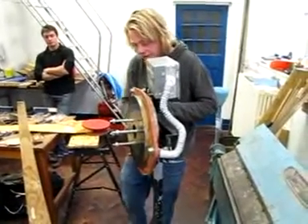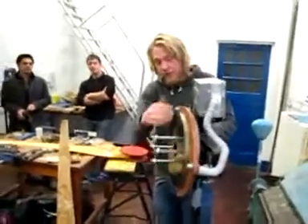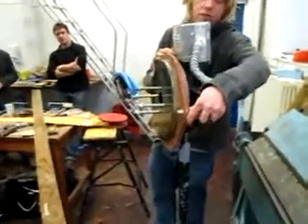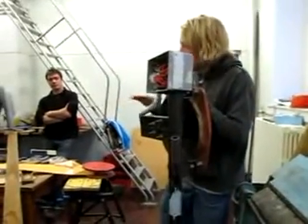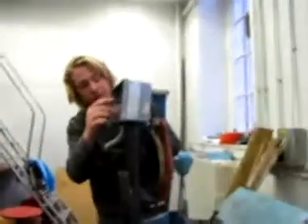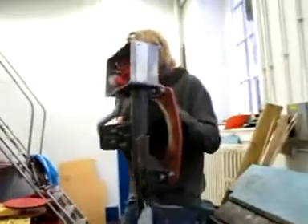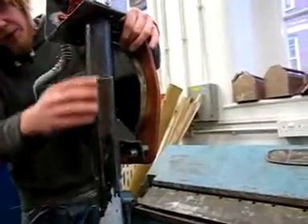The blades are attached to the rotor. At the back of the rotor is a bearing — a wheel bearing from the back of a car axle. As the blades spin round, it spins the rotors, and the magnetic flux cuts through the copper coils, inducing an alternating current. The alternating current is transmitted through the wires through a conduit into a box, where it's converted to DC direct current for charging a battery through bridge rectifiers. There's also a yaw tube so the turbine can spin round to face the wind as wind direction changes.